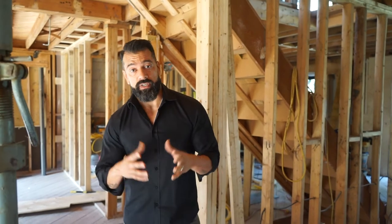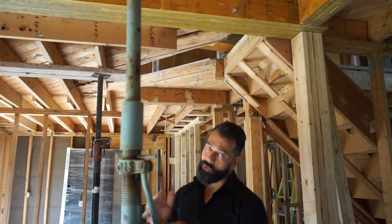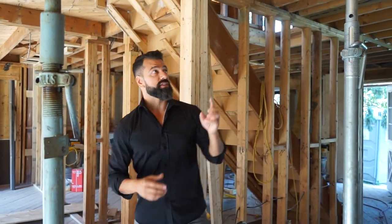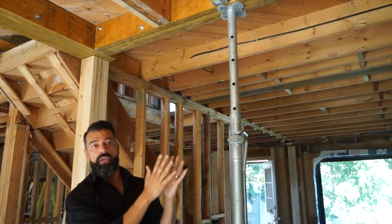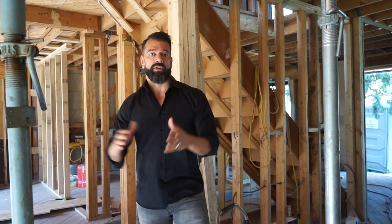Just behind me you can see a metal plate, which was used to solve another major engineering problem. The engineer designed this house with LVLs, but our floor joists are 8 inches and the LVLs being put in were 9.5 inches — meaning we'd have to drop our entire ceiling or have bulkheads everywhere we opened walls. We went back to the engineer and said that's not acceptable. He redesigned it using an 8-inch LVL with added metal plates and bolts, giving us the strength and rigidity to support the upstairs floor. Now we have a nice smooth ceiling that looks like it was built from the ground up, not a reno full of bulkheads.